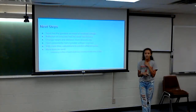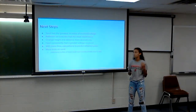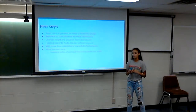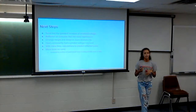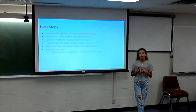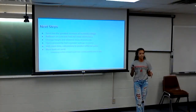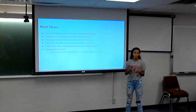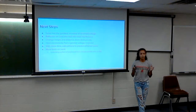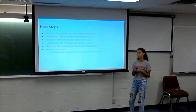If we had more time, and for future groups, we would recommend changing the height and distance more dramatically. That's important for the time delay between the reflected path and the direct path. Our calculations at three meters showed only about a two-nanosecond delay, which isn't really enough to give you a good prediction of when your reflected path is arriving. If you can get much higher or move the antennas a lot closer, you can start actually seeing when your second reflected pulse is coming in, which would be a lot more beneficial for the data.